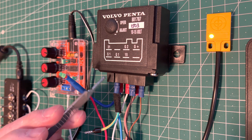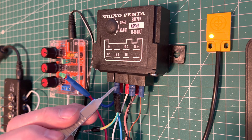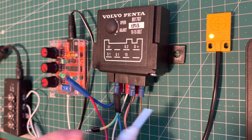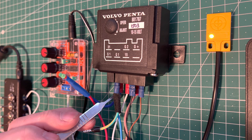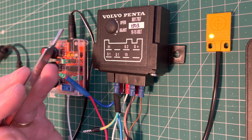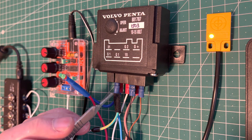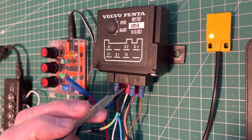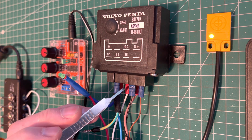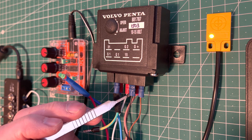Sitting on pin 1 we've got ground, with a connector there for my oscilloscope. There's nothing on pin 2. Pin 3 and 4 is the proximity sensor wiring. Pin 5 is the supercharger connection — the supercharger is represented by an LED here, so when that lights, that's the supercharger coil being engaged. Pin 6 is the feed from the engine; in this case it's the signal generator. And then finally pin 7 is the 12-volt supply into the controller.